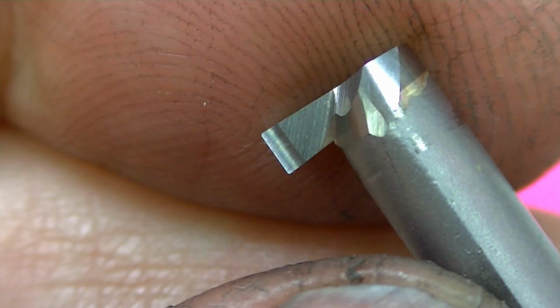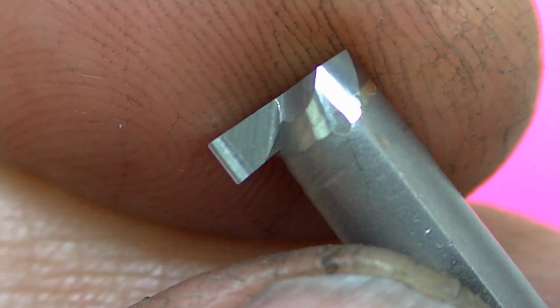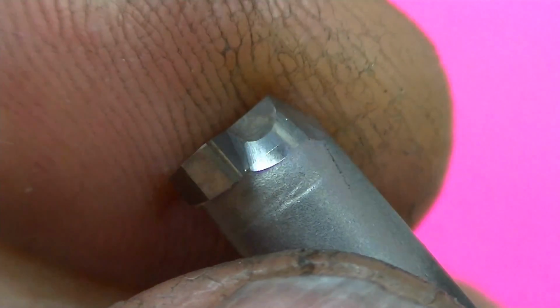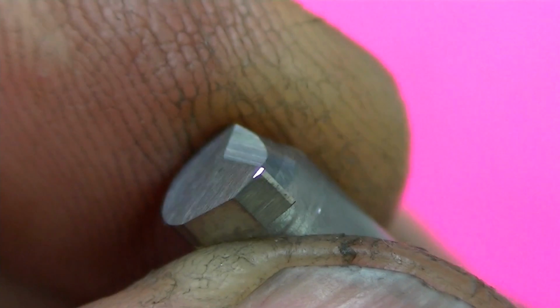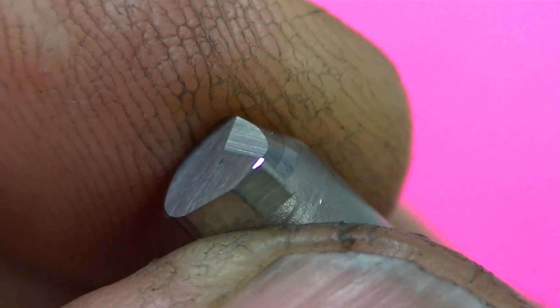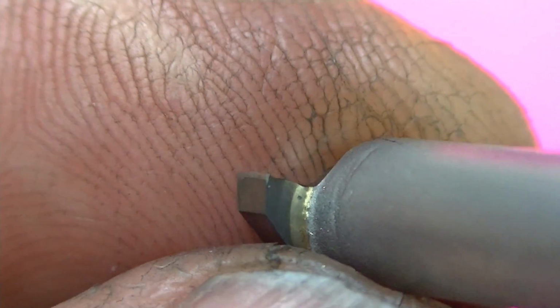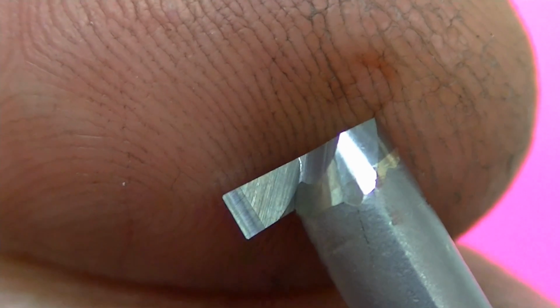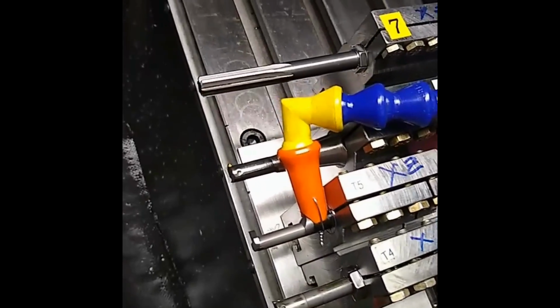You can see our lapped cylindrical chip breaker there. And then we'll get the glint on the, right there is our cutting lip that we lapped also. There's the chamfer. You see the glint there on the chamfer on the 45 on the corner break. Same thing on this side. So that's it. Here's the gang tool setup that these bars go in, and there is the groove tool and the boring bar.